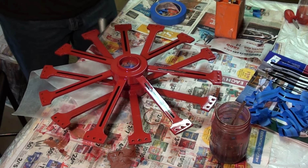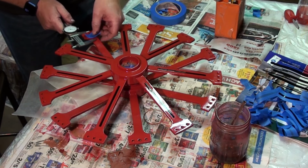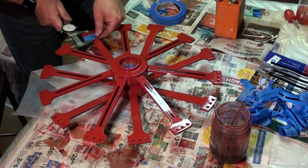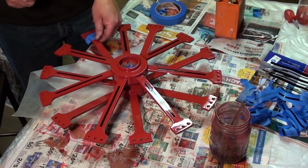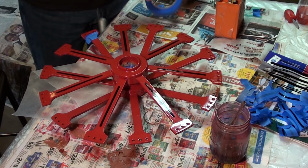Three to five coats of primer were used, with sanding after the second and successive coats to achieve a very smooth surface. Because of the red color we selected for the wheels, many coats were needed to build up the proper color. Successive sandings between coats were needed after letting the paint dry, generally for a week or longer between each coat.